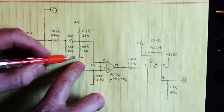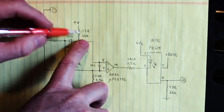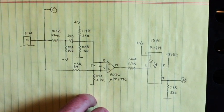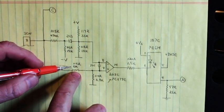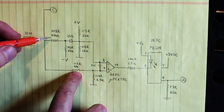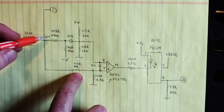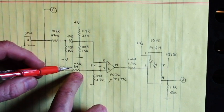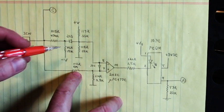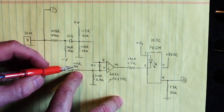118R, the 18K going to power supply ground, and 117R, 33K going to plus 5.6 volts DC. The 1 megohm resistor here is good. Now I had to lift these two up off the board to measure them, because there is a lot of parallel circuitry going on here. If you measure them on the board they won't measure right, but if you lift them off the board they will measure correctly. The 1 megohm resistor in position 112R on that board measured good.